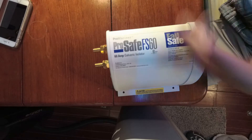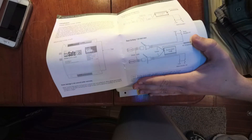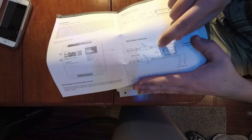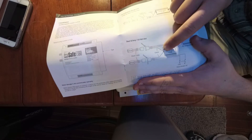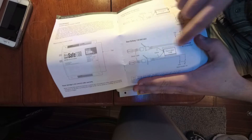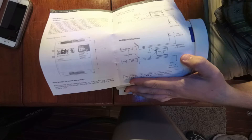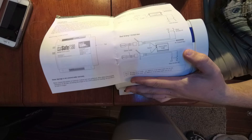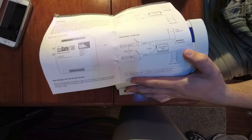The wiring diagram for this is actually quite simple. All we're going to have to do is disconnect the shore power cables, and then take the two grounding wires, put them on that post, and splice in the AC grounding bus on the other side. It shouldn't take too long. I've been told this is one of the easiest things to install, but we'll have to go ahead and disconnect the shore power and get to it.